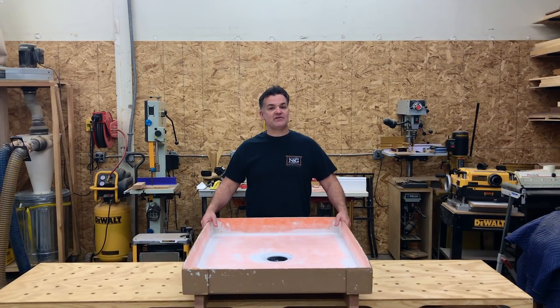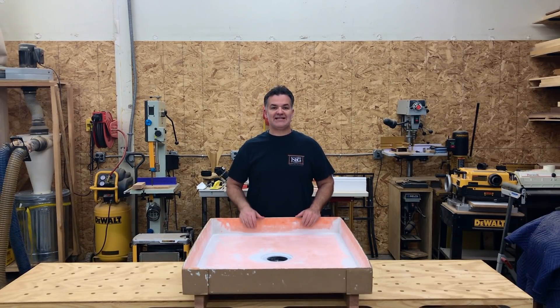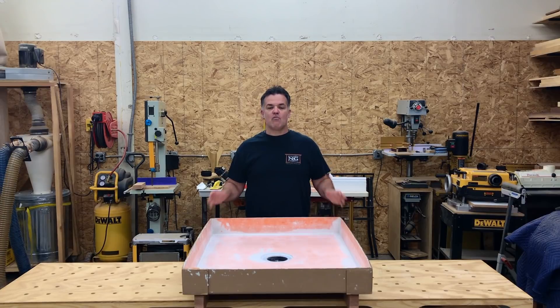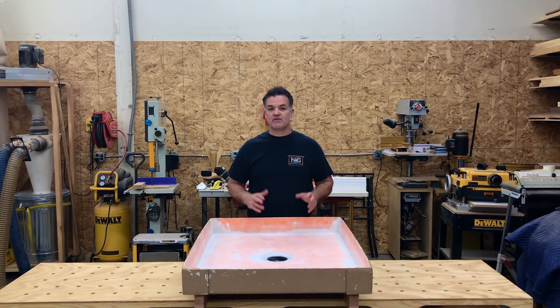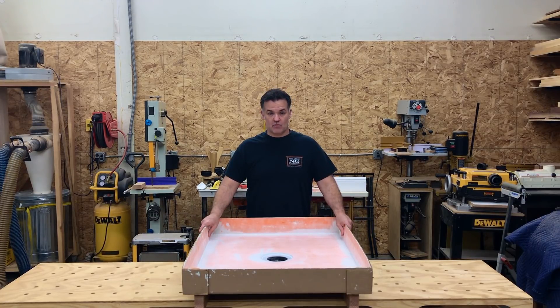I also made the test out of cardboard. That's because we are going to put 15 gallons of water — that's 125 pounds of water — in this test, and I want the joints to get flexed a little bit. With that much water it'll push out on the cardboard and stress these joints just like it would if your wall was going to move or dry out a little bit, but it's going to exaggerate that with the cardboard.